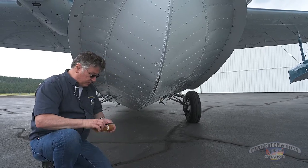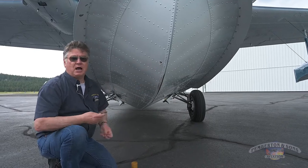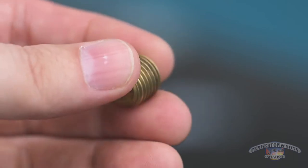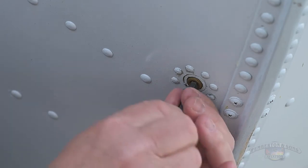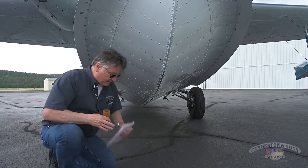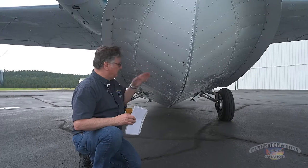About every five hours we lightly grease those plugs so they don't gall. It's also noteworthy that these plugs are brass because you're threading into an aluminum boss. Aluminum on aluminum will gall, and stainless steel will also gall — brass tends to be very good. If you strip one of these bosses out, you're looking at having to re-rivet, re-PRC, seal, and reinstall. So during pre-flight, I go along and check all 11 hull plugs plus three in each float.